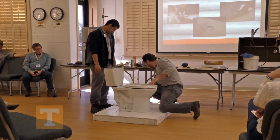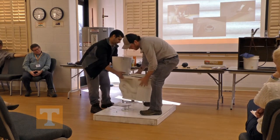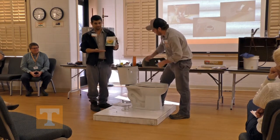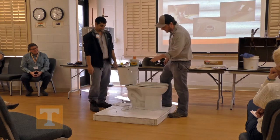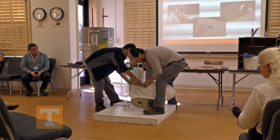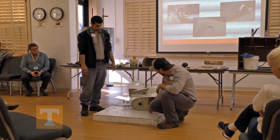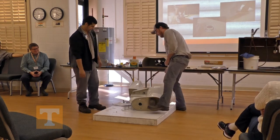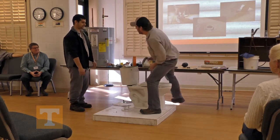We'll show you the underside. There will be a wax ring on here that will be squashed flat. It may come off attached to the bottom of the bowl — it's going to be messy. You're going to have to scrape that off and clean it up before you set the bowl back. If you're able to get it outside, you can see the possibility of getting to whatever's stuck there. With needle-nose pliers you might be able to lock onto it and pull it out.